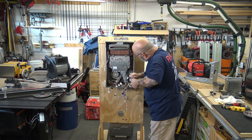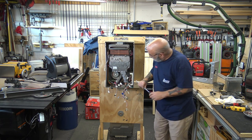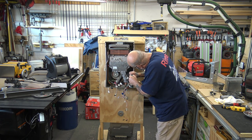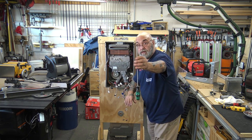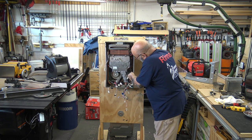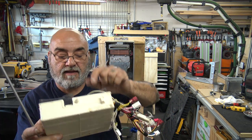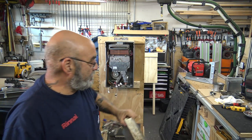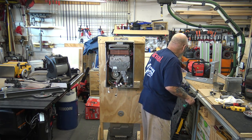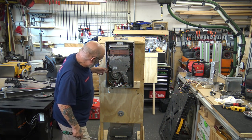Take off this plastic shroud — it's a lot easier to get to the screws. There's a screw all the way in the back. The PC board falls into a pin, and there's the screw in the back. See how filthy this is — this is a condemned unit I use for demos. Your wiring is done and out.